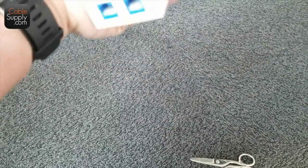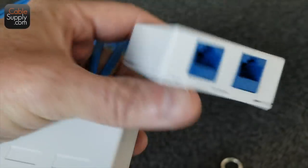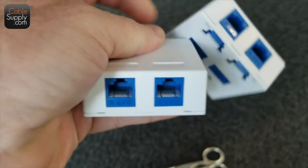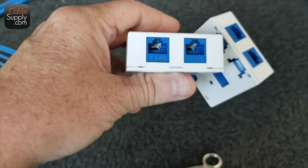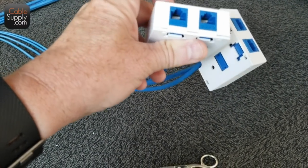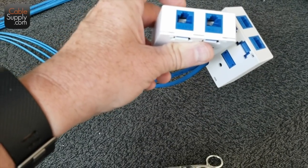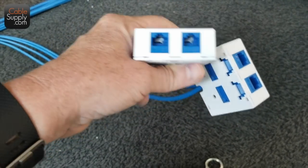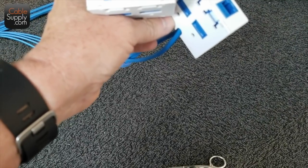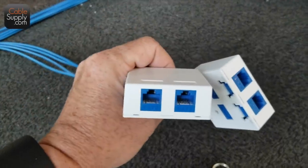It's kind of busy here. We're trying to rush around to get these people installed, but these are called surface mount boxes. They have little stickies on the bottom if you want to stick them to something. And you can get them in different sizes. You can get single boxes, dual box, you know, a two-port one. You can get them all the way up to 6 or 8 ports sometimes if you need it. Sometimes it takes the place of a patch panel if you're only pulling, you know, 4 or 5 cables, and you just put in a surface mount box